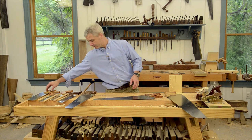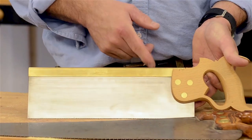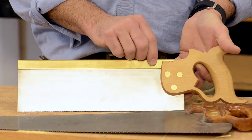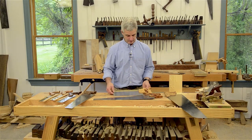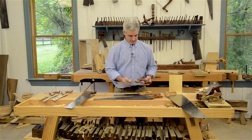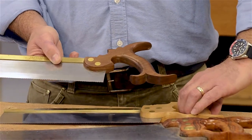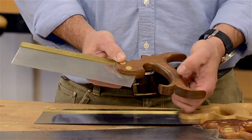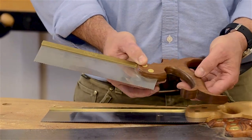When we start talking about other types of saws like backsaws, the one thing that differentiates this saw is pretty much simply the back — this one has a stiffening back. And oftentimes the handle angle will change a little bit too depending on what type of saw we're talking about. Here's another backsaw, but this one instead of having a closed tote where the grip is completely enclosed, this one is open. They're a little more delicate, usually used for finer work — with the short grain there, they're more prone to snapping off, but for lightweight work they work just fine.